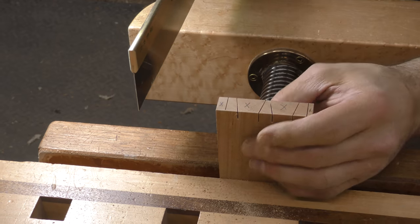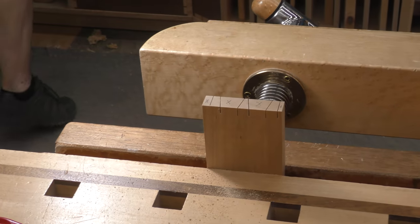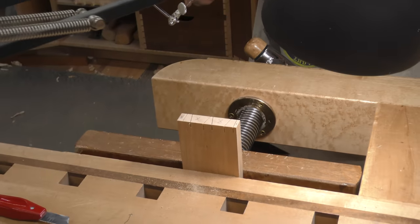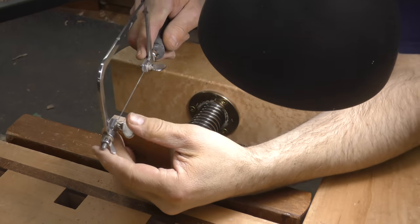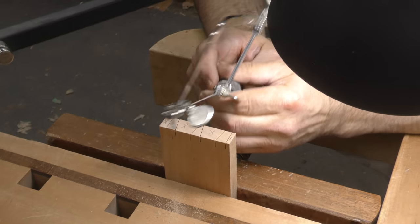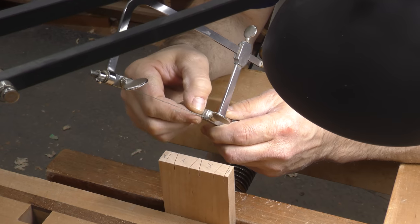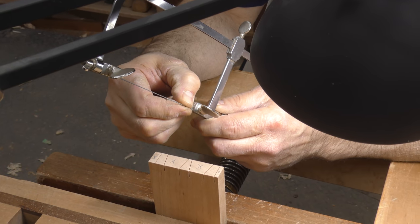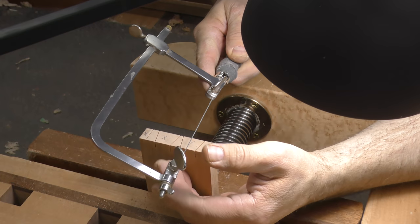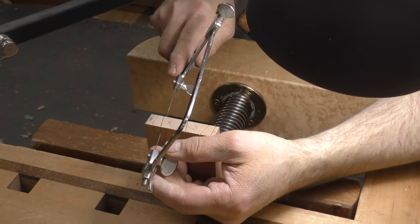Now, if you're witnessing dovetails for the first time in this series, then you're going to notice how much faster through dovetails are as opposed to half blinds. Remember I've twisted my blade. I didn't show you how you set this up, but because it's only a 3-inch depth of throat, you give that blade a little twist, about 30 degrees, top and bottom, so that when you make a horizontal cut, the frame stays up like this. So when you drop down the kerf, you've got to lay your saw over to get that blade straightened out.